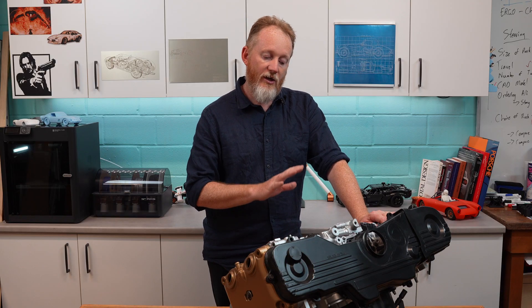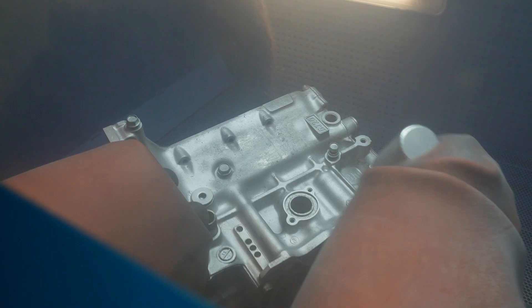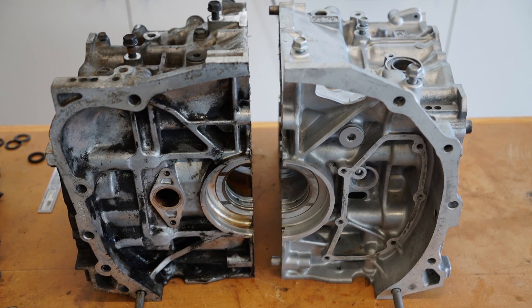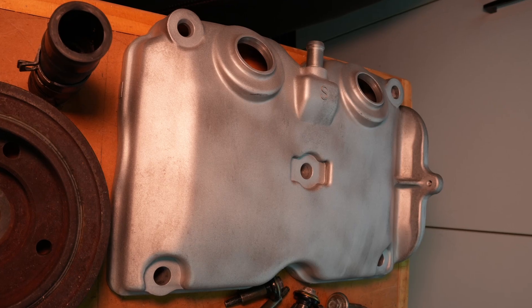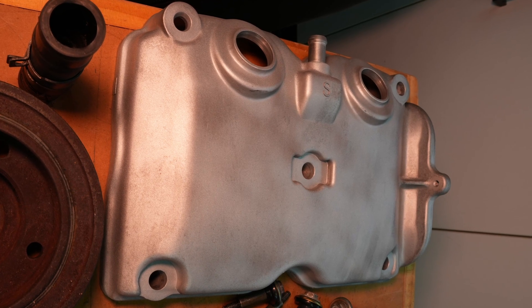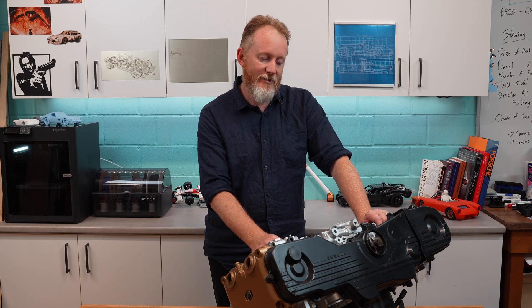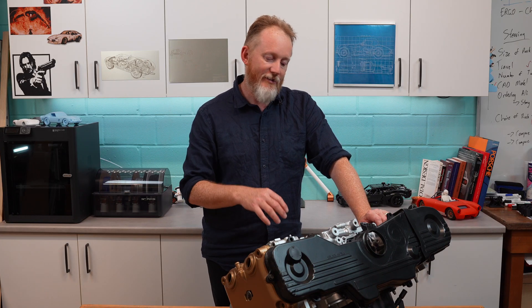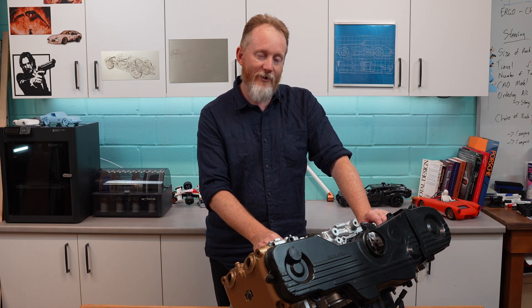I didn't really need to worry about protecting any of the surfaces or getting sand into crevices. So once we degreased it, we gave every component a good sandblast — cleared off all the gunk. You can see a really good comparison between something that's been degreased and something that's had the sandblasting process done to it. I actually quite love the sandblasting process. I like taking something that's pretty messy and taking it back to bare metal. It's almost like the Marie Kondo of engine work — removing the things that don't spark joy, and there's no joy about dirt and grease all over a motor.